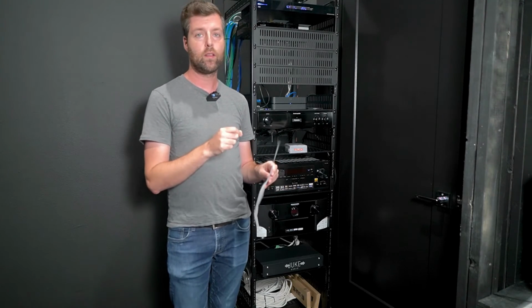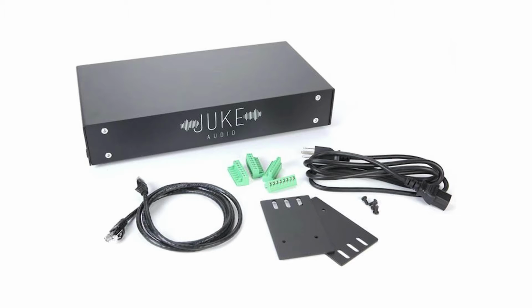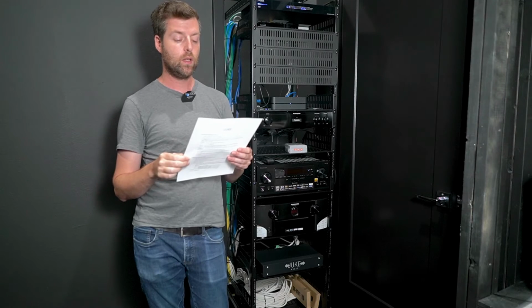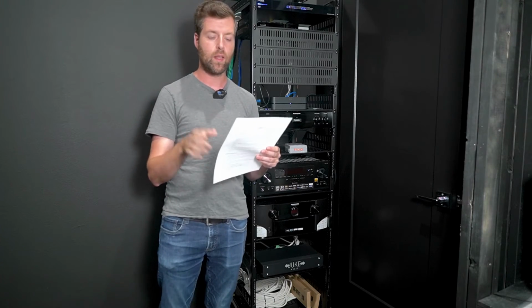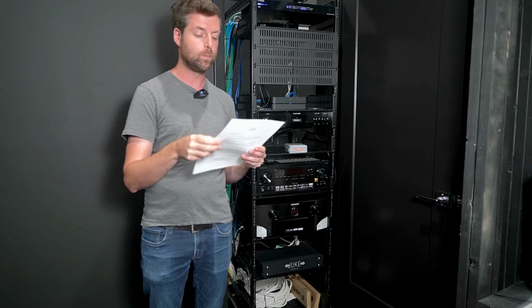It has speaker connectors on the back, no line level connectors, and it uses those green screw down type connector blocks. They're pretty easy to use. They support anywhere from 12 to 22 gauge. You need to strip the wire to fit in there. You can't really use binding post connectors or banana plugs or anything like that. You're kind of stuck with it, but for this purpose it's fine. It's not really an issue.